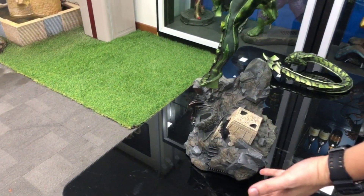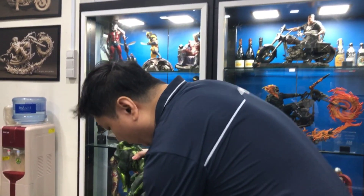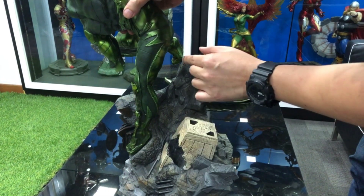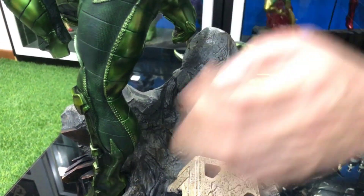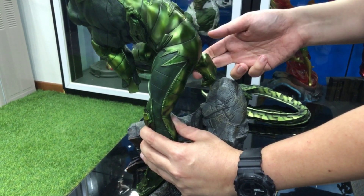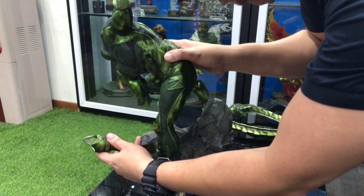If you go in the wrong direction it's not going to work and will create a lot of issues. Because the front peg is the larger one, people might be inclined to put it in first, but that may not work out easily. When you fit the bottom front peg in first — it has a bigger allowance — you're focused on that and not really focused on the back. Once you think the front is in, you realize the back peg isn't fitting and it's only a few millimeters away, giving the impression it just needs a bit more force.